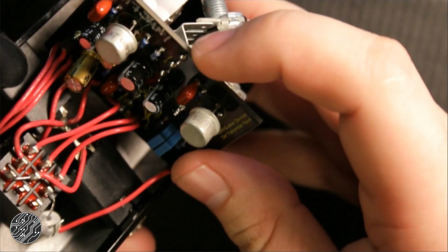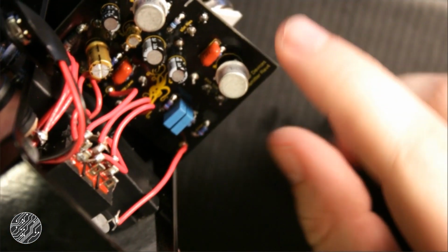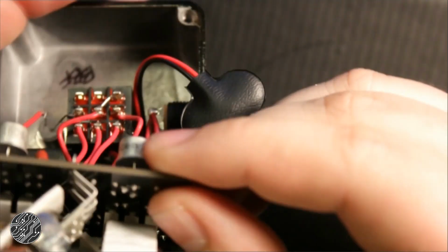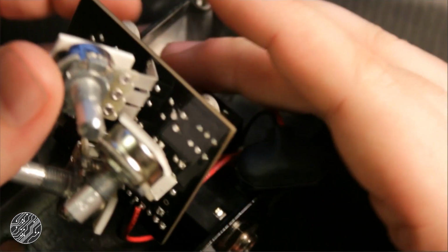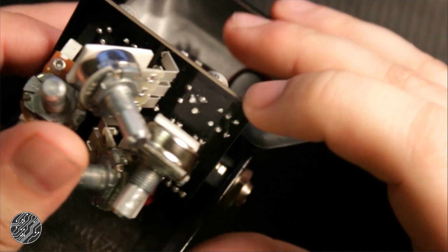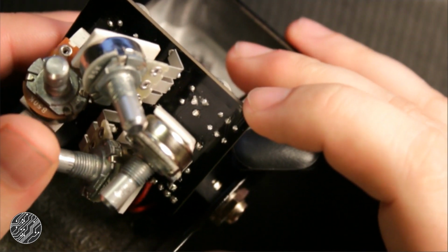Let's see, the bias pot is probably a good place to start, because biasing generally, especially if this is Fuzz Face based, is controlling the voltage going to Q2, which I would guess is over here. 1, 2, probably. So this 3.3K resistor does seem to connect to that voltage rail, and then connects to, yeah, I think it connects to 1.